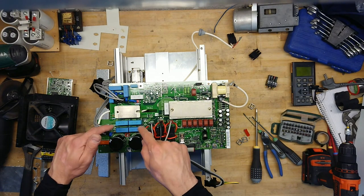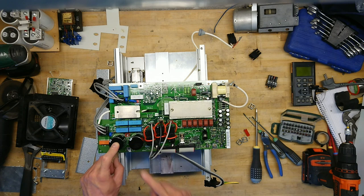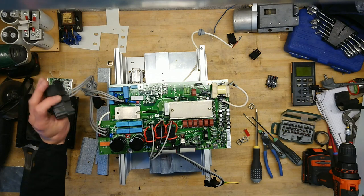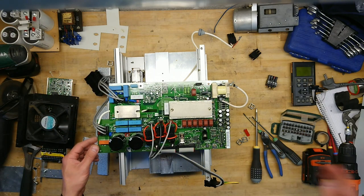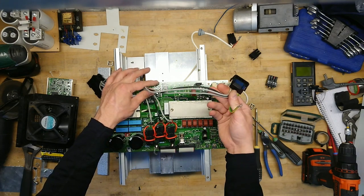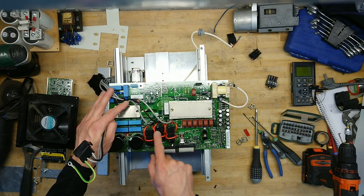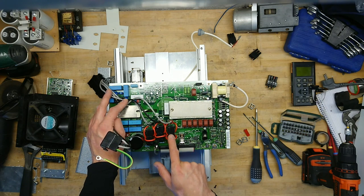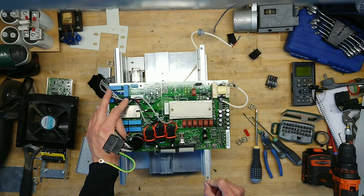After the rectifier we have the filtering with two filter capacitors here, which are EPCOS 470uF. Then there is an external DC link, as these can be linked up — you could have one big power supply and put more and more drives in series with it. Here we have the output to the drive itself, marked with UVW, and there is also a current transformer for each output to monitor the current. These are CSN C241-500.